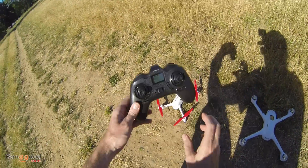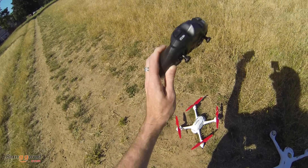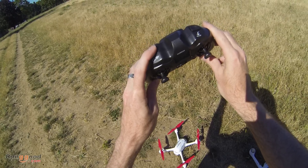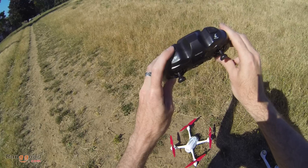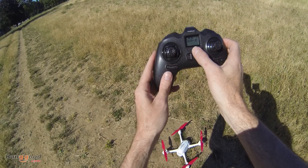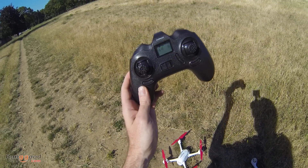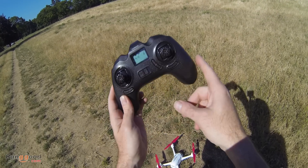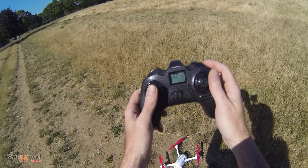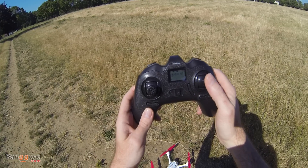Now the transmitter is pretty cool. It looks like some of the other HubSan transmitters from the earlier models. It does have photo and video buttons up top — press it for half a second to take a photo, press it for a second and a half to start the video, and a second and a half again to stop and save the video file. On the right hand side you have your return to home button, which we're going to test out. It also shows you how many satellites — right now I have 10 satellites connected. The transmitter does not have GPS inside it since this isn't the follow me version. You have your trim switches, on/off button, and we're in mode two, so throttle is on the left with a self-centering stick for altitude hold and GPS lock.